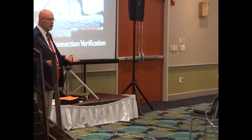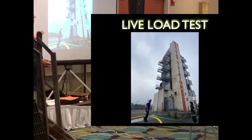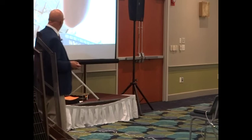This is the first fire tower in the nation that got its railings raised to 42 inches. And they also load tested. I've never in my whole life load tested a tower. So in Oakland, we load tested two fire escapes on the other side. They got load tested. What is load testing? Well, it's a combination of bags, or you can do one of these. Ready?